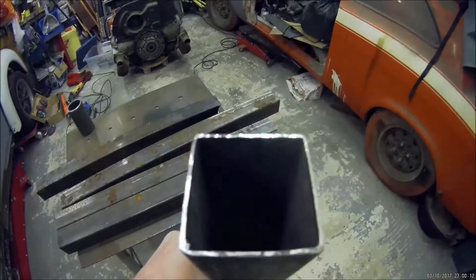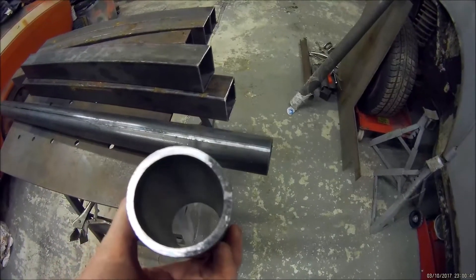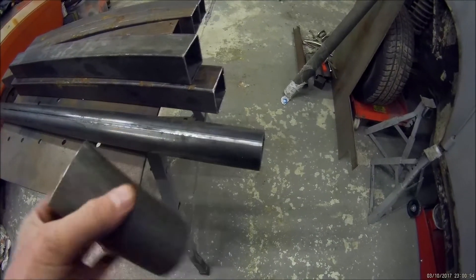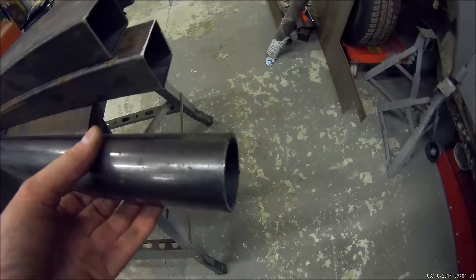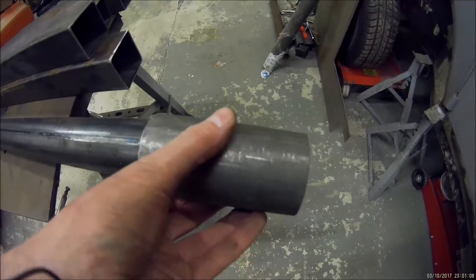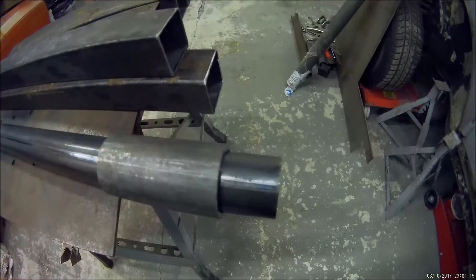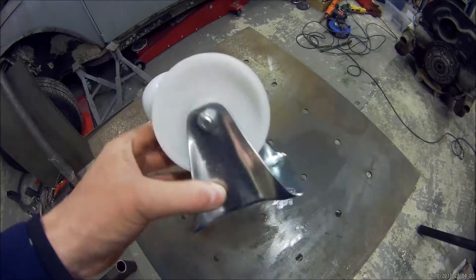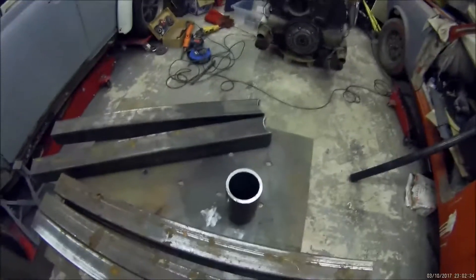The pivot is going to be made from 60mm diameter, 5mm wall round tube — this is CDS, it doesn't need to be that good, but that's what this is. Inside that I've got a smaller tube, I think it's 48.3mm or something like that, three mil wall welded tube. The two fit together quite nicely, not too much slack — that'll be the pivot. The casters I've chosen to use are quite beefy; I've got one pair of fixed and one pair of swivel lockable. This is how the basic frame assembly is going to work.